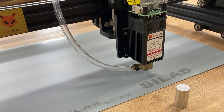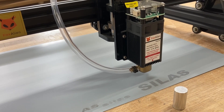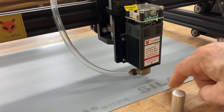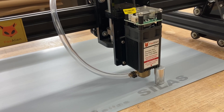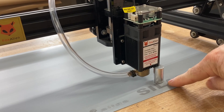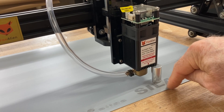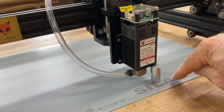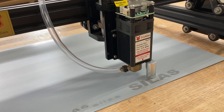I'm using the Fox Alien riser CNC machine. This is the 20-watt laser that I have, which means it puts out about 5.5 watts of output power. When you set this up, you're actually engraving onto the steel itself. You're going to set the height based on this being the surface that you're engraving on, because what is actually happening is that light is shining directly through that acrylic, burning onto this metal. That metal heats up, and that transfers the image onto the acrylic. That's the process, and that's how it works.